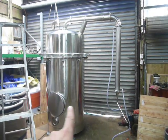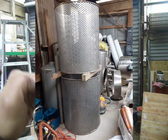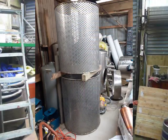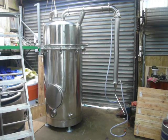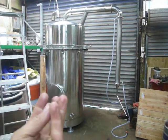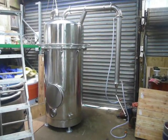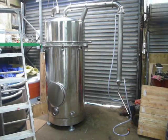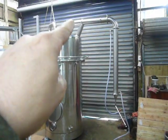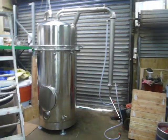This thing has a ring around the center partway up, and there are baskets that get popped into the top. The bottom is filled with water, which is turned into steam. It percolates up through these baskets and all the botanicals' oil and essence is extracted. It comes up the top here through the lyne arm, down through the condenser, and out the product takeoff tube.